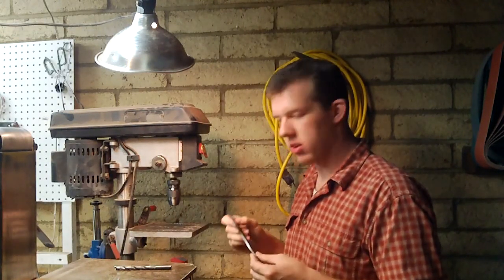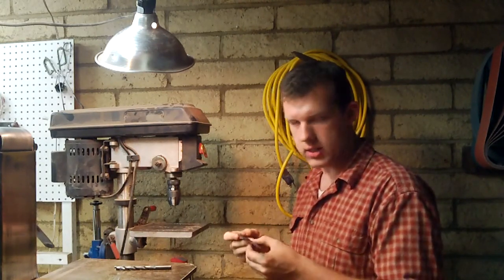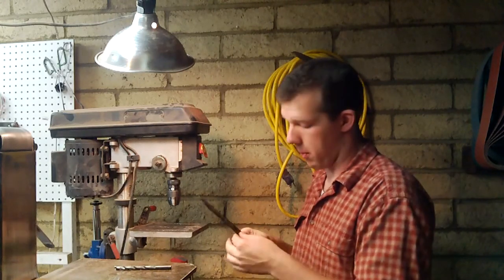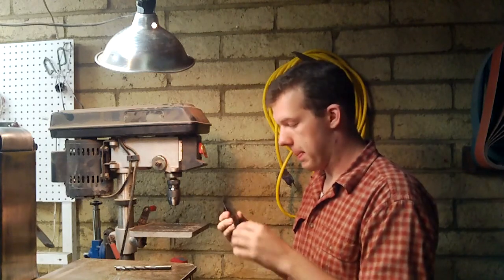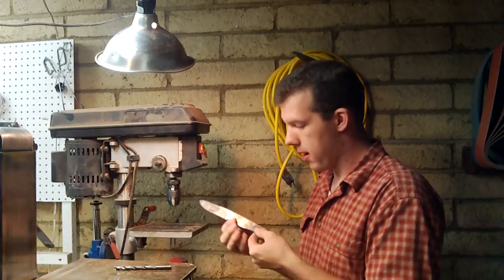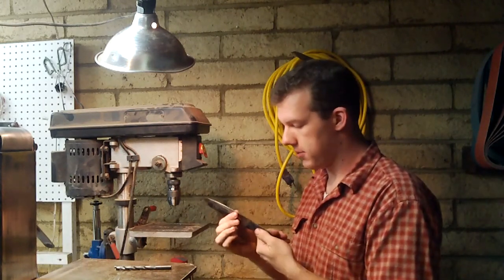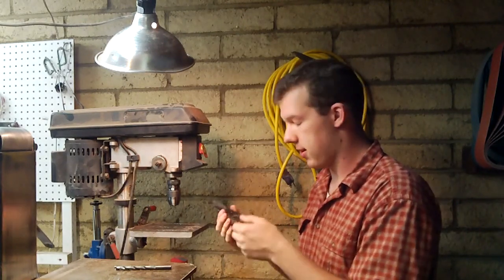Now, we drilled out the pinholes before heat treat because I didn't want to have to worry about running into hardened steel, because we have to have these. But I love the tang soft. I didn't harden the tang, but it may have hardened as far down as even this far. Which is fine. I'm not going to drill above this first pinhole. I want this area to stay strong, because this is where the strength of my tang and the strength of my handles come together. Any force that is applied, that needs to stay strong.